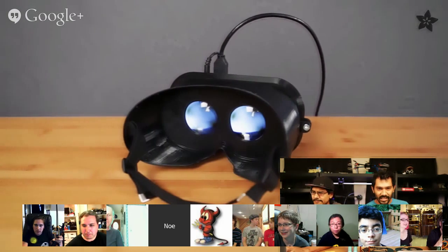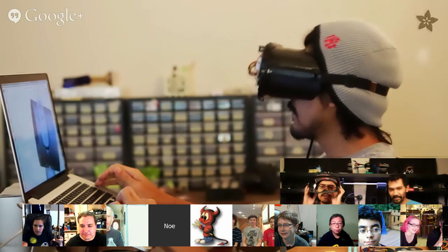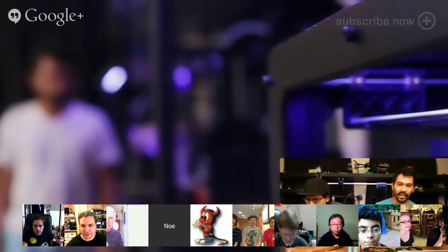This week we're releasing our DIY video goggle design. This is really cool for anyone who wants to make their own wearable display, or maybe if you're a camera operator or a DP — it's a pretty good alternative to an HD monitor with a hood on it. A lot of designs out there are just boxy, not editable, just one material. We thought we could do better: make curves you can edit, adjust for your face, cheeks, and nose. It's dual printed — PLA framing with a NinjaFlex hood, so a stiff body with a soft face contact.